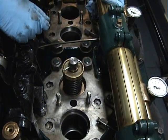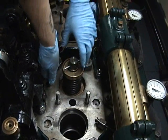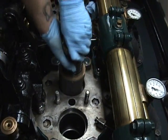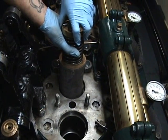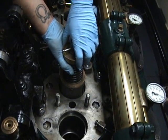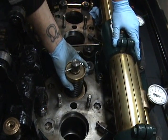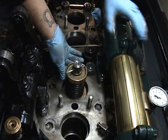Alright, hello engineers. We're working on the Washington in the catalyst and we're doing the Kerplunk test. The valve cages in the Washingtons have a tighter fit to try to disperse the heat a little easier. But that tight fit can be troublesome because any little ball of soot will keep the valve cage from going into the head.